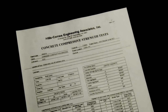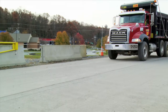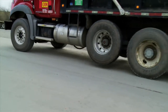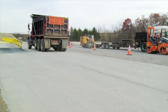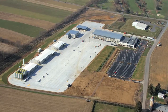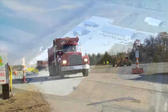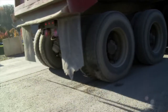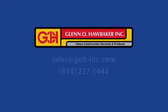The finish strength of the concrete will be in the 5,500 to 6,000 PSI range. The finished surface has a slightly rough appearance compared to the standard finish on a highway. This material is not intended for vehicles traveling at speed. It is ideal for areas that will experience low-speed, heavy traffic, and it is not subject to surface shear under the turning wheels of heavy vehicles. Shown here is a large parking area built for Baker Hughes to store heavy equipment used for gas well operations. Roller compacted concrete can be an effective paving material in applications that require the strength and characteristics of concrete without the burden of all the costs associated with traditional concrete paving methods. Contact us for consultation and pricing for your specific projects.